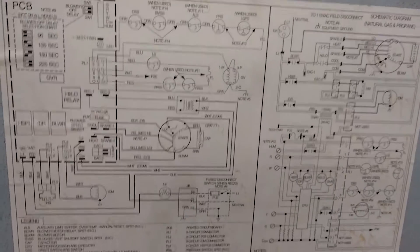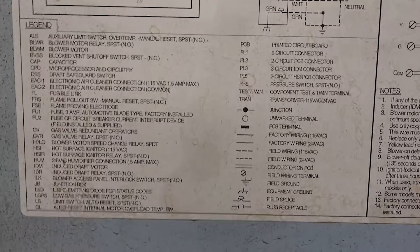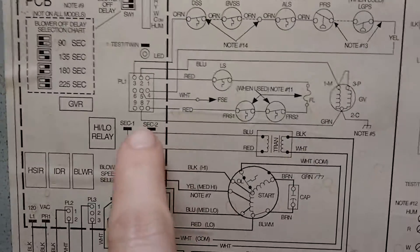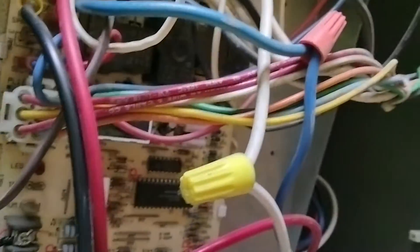Unfortunately, not all wiring is as cut and dry as you would think, and in this instance you have to actually look at how this is labeled on your legend, which most of you should have. You can see there's also a pin harness here, and you have to follow where your limit switch wires actually go to. You're going to have to follow them all the way down to the board — I've already traced them back, and you can see they are in pin 7 and pin 1.